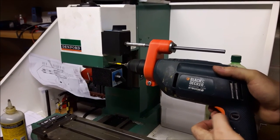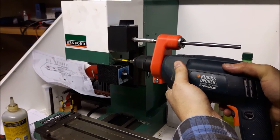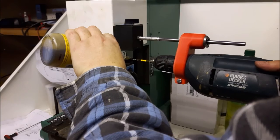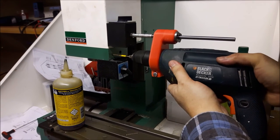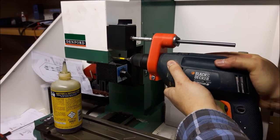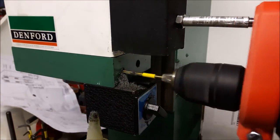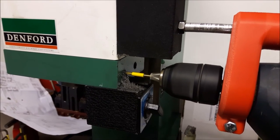Here it is all set up, just starting to drill with a small bit first. One of the tricks I found was that filings from cast iron are really abrasive, so rather than get them all over the machine I used another DTI stand magnetic base just to capture all the filings — that seemed to work really well. I lubricated the drill bit and it just slides in and out on the piece of linear rail, keeping everything nice and square. A few extra spots of cutting fluid and some elbow grease, and we're nearly there — you can see the filings all sticking onto the magnetic base.